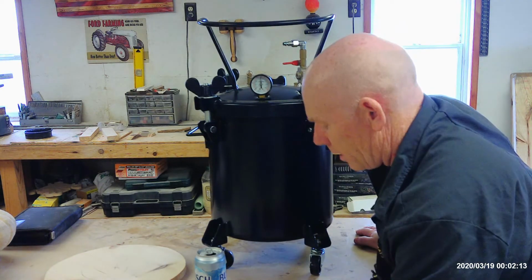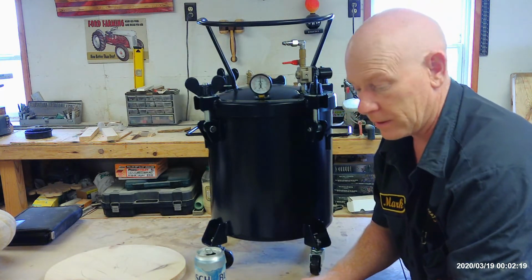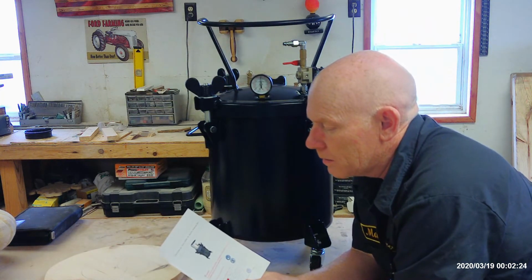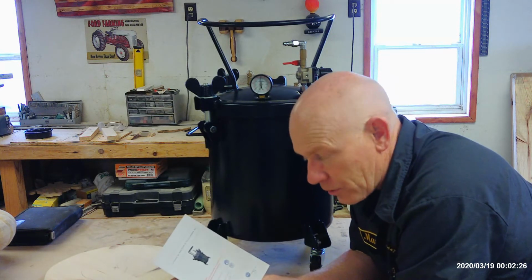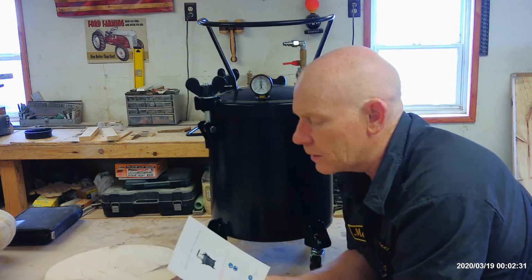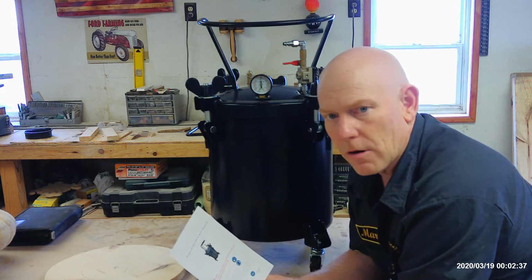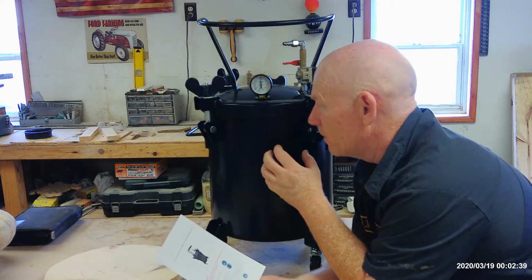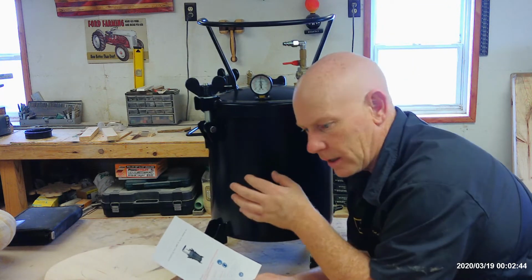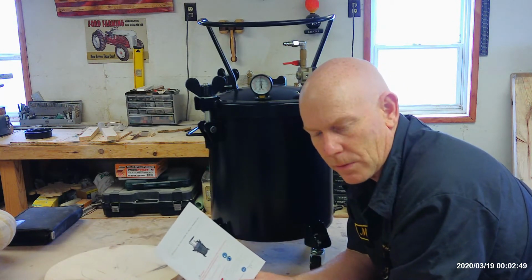All right, so if you're looking to buy one, this is not a sponsored project. Literally, this was a birthday present. If you're doing resin, buy the California Air Tools Model 365 Charlie Whiskey. CW, for those of you that aren't familiar with military phonetics. Make sure you get that model number, because I was looking on Amazon. There are multiple different model numbers that look identical to this pretty much on the exterior, but if you take the top off, it's got a paddle in there for stirring paint. It's got a siphon tube, things that have to be removed.